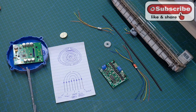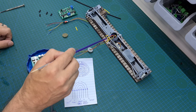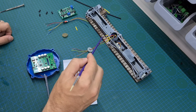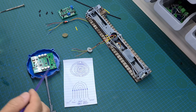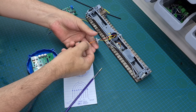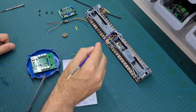I've now connected each of these wires. I did have to use much smaller heat shrink tube - the larger size was still too big for this wire. Basically all I did to attach them was tin each side of the wire, solder them together, and then place the heat shrink tube over the top. The next step is fitting this over the slip ring and gluing it in place just under the lip here, which takes care of the wiring to the bridge.